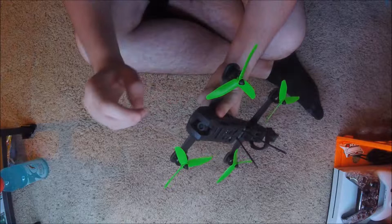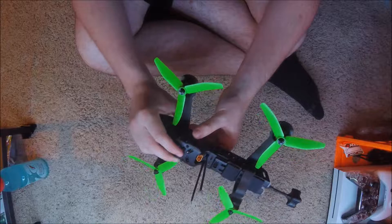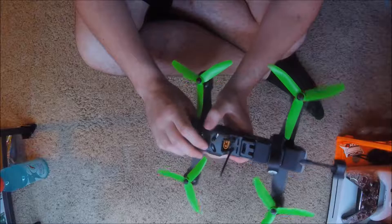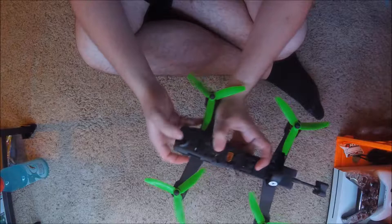The only downside to this thing: this is the original Zero Zero camera. It's garbage, honestly. I'll be honest. I've found ways to work with it but it's really just not that good of a camera. I'm going to put an HS1177 in there someday. What I did is I bumped the power output to 500 milliwatts because I was getting this weird flashing with the camera — very obvious in my FPV feed and almost hard to fly. The OSD wasn't affected; it was just the camera flashing. As soon as I bumped it up to 500 milliwatts, it went away.